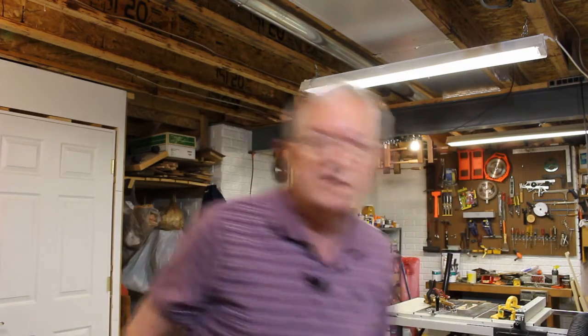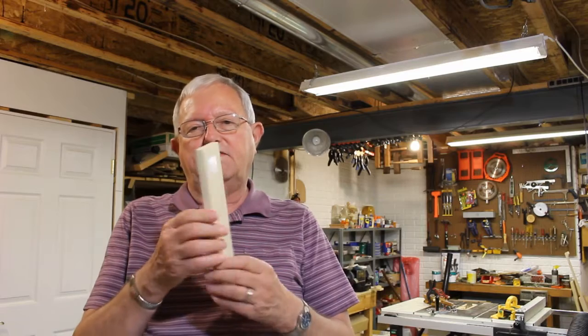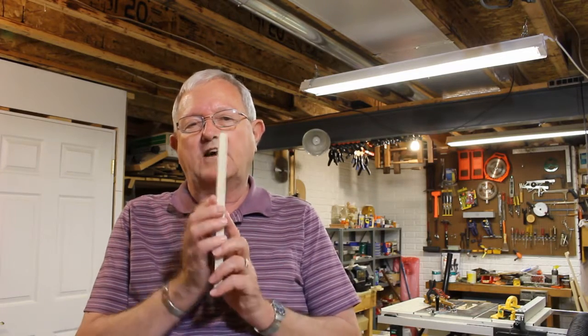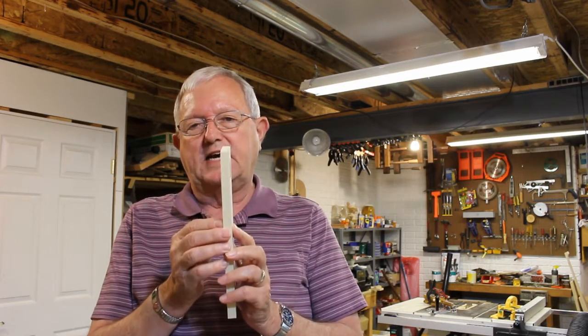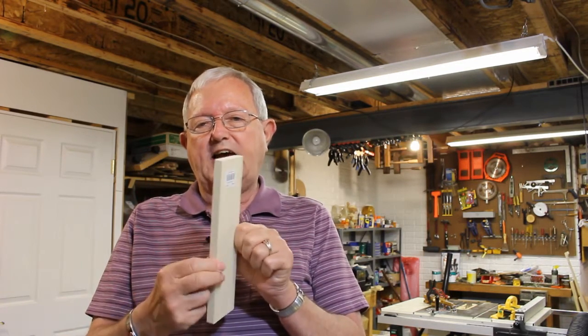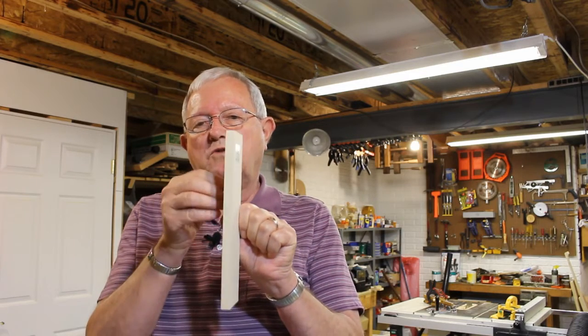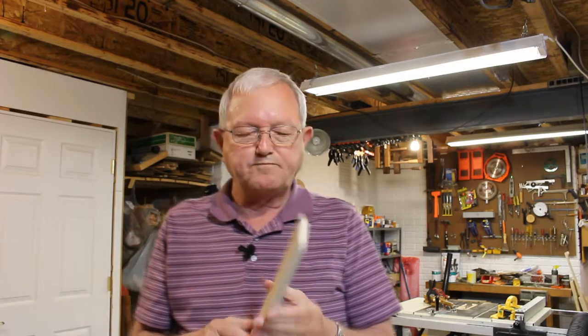To make that frame, I went down to the local big box store and I bought some 1/2 inch by 2.5 inch poplar. And the reason I bought that instead of buying 3/4 is I only wanted 2.5 inches, so it's thick, so it saved me a lot of milling time. The 2.5 inches, I'm going to rip it down to 1.5 inches for the side, and then the piece that's left over will form a piece inside to make the shadow. You'll see as we go along.